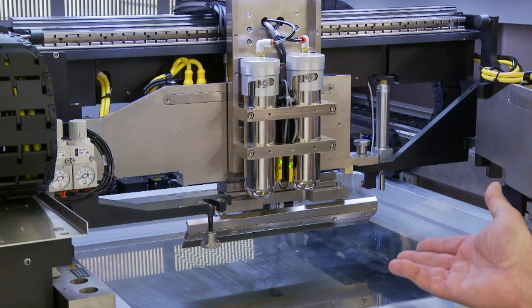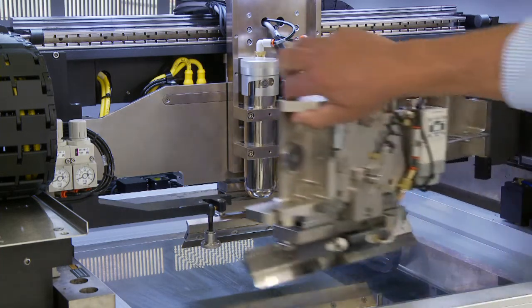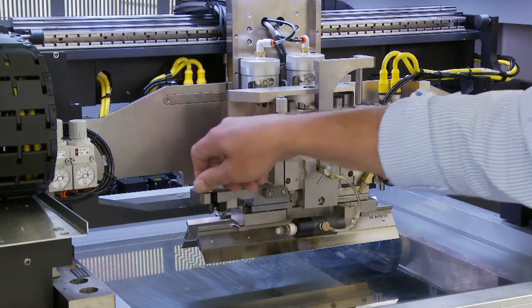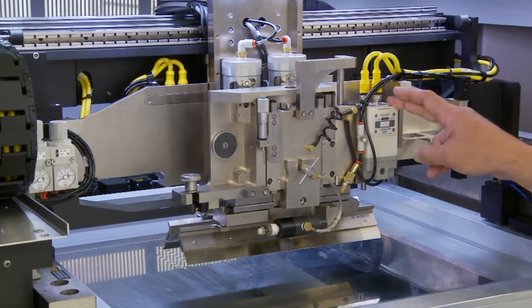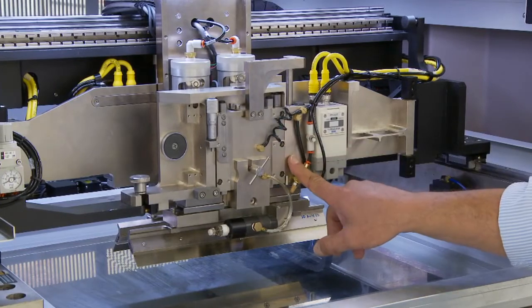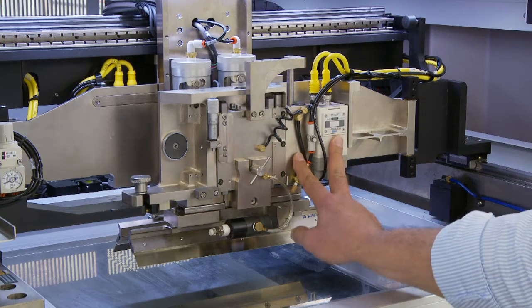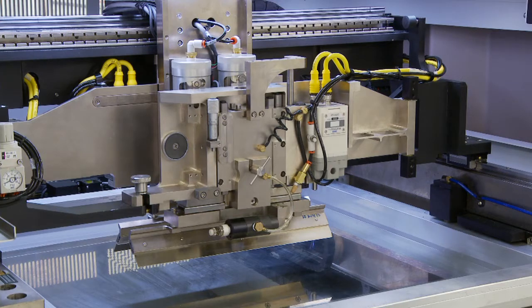This particular model, the Essentials, being cost effective, we offer pressure loop control on the squeegee print, which is controlled by a proportional air valve, computerized, located directly at the charging device which applies the pressure to the print. This design eliminates any latencies in the control of the function and generates a very highly responsive closed loop on the squeegee pressure itself.